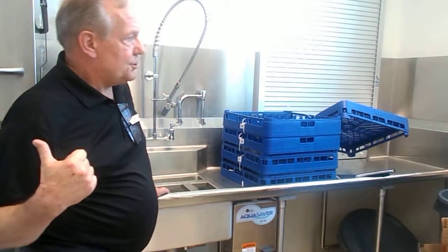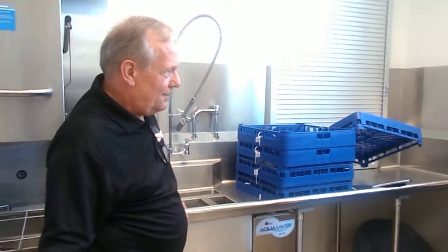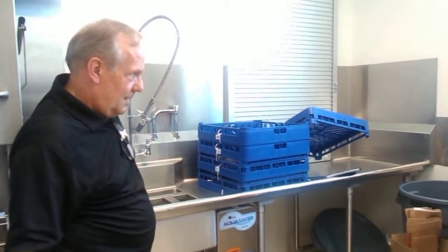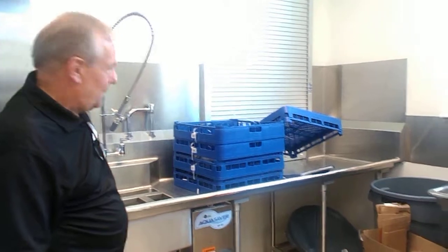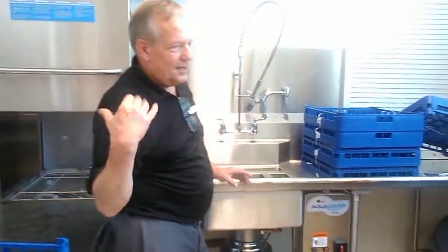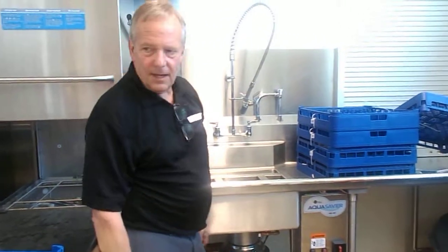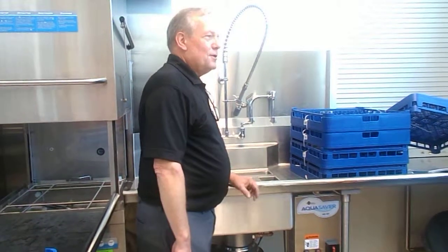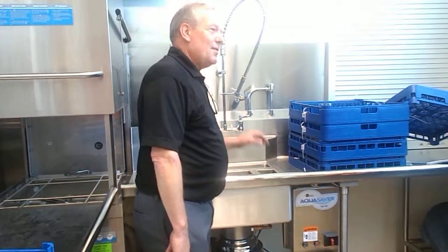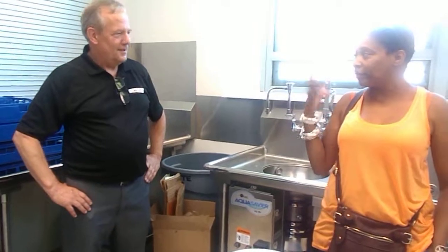I saw that you have an ice machine. A neat little trick with disposers is, again, if they're not cleaned and rinsed thoroughly, periodically, they get funky. Yes, they do. My advice is grab a little bucket of ice, throw it in there. It's solid, so through its grinding process, the ice cleans it a little bit. So ice is a great preventive maintenance for cleaning the disposer. If you have an orange or a piece of fruit, throw that in with the ice. The chefs always tell me to put an orange in it, and it gives it an orange-like smell.